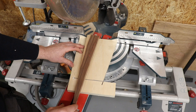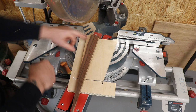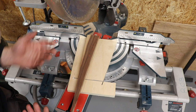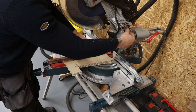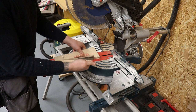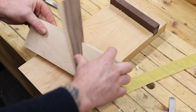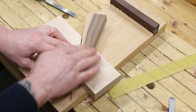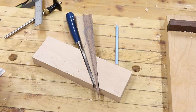I have my piece of walnut set up now - I've just double-sided sticky taped it to a piece of plywood, since it's not long enough to go against the fence and you couldn't hold it safely by hand. I have my laser lined up exactly at the correct angle and I've also set a 10 degree bevel in the blade. We're going to cut this now and it should be very straightforward. There we go - that fits in there perfectly, so our angle is spot on and the wedge is sitting in nicely. Now I need to thickness this piece down so it's flush with the face of the plane.